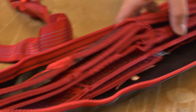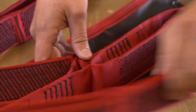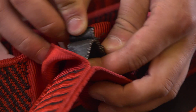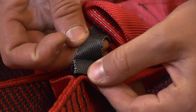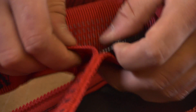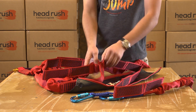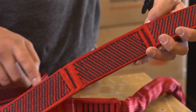Open the OPA and make sure the black activation strip at the center of the OPA is still intact. Inspect the entire assembly to ensure no threads are broken and the webbing is in good condition. If there are any broken threads on the black activation strip or in the zigzag stitching panels, an overload event has occurred.